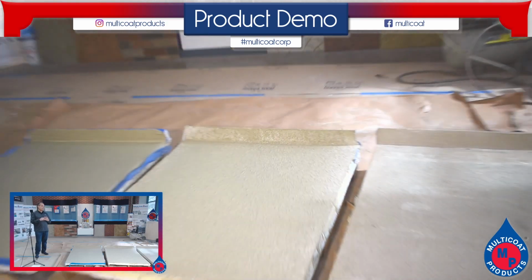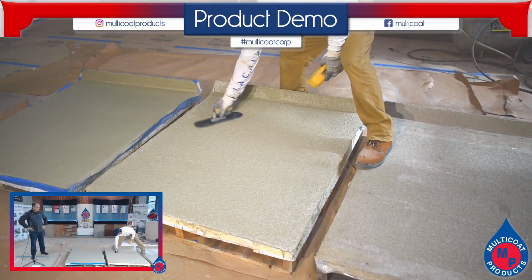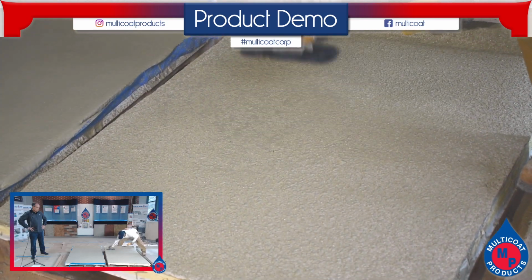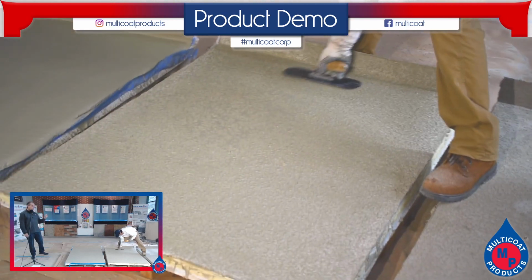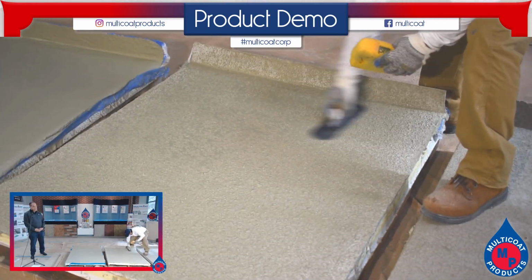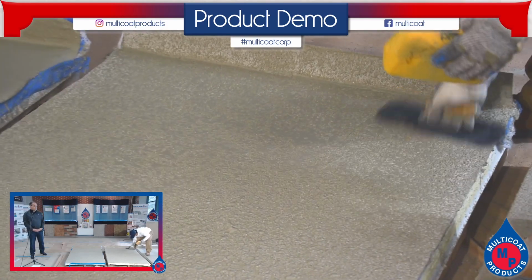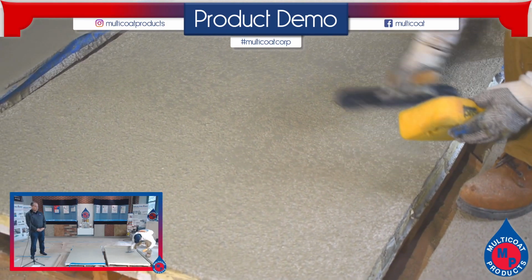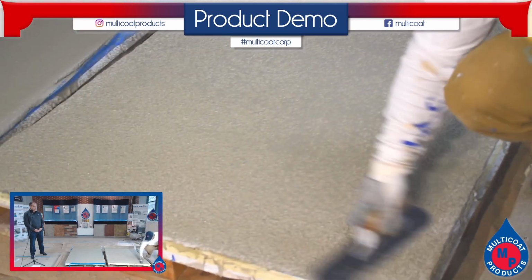It's probably still a little wet, but we're going to try to knock it down since we're live here. Again, because our creek coat comes with dry polymer, you only mix with water. If you're doing this knockdown texture, especially on a concrete deck, whether it be on the ground or elevated, it's 6 times more breathable than using any products where you got to mix a glue. So it makes it less likely of having any delaminations from hydrostatic pressure.